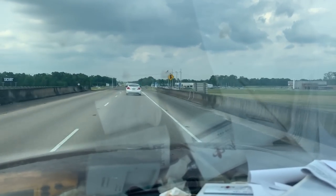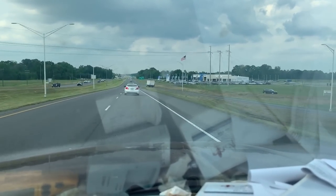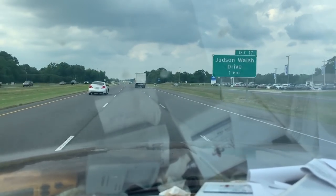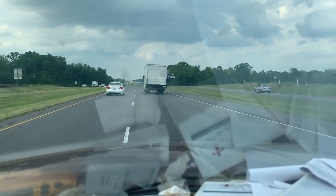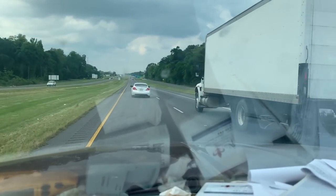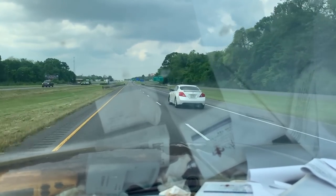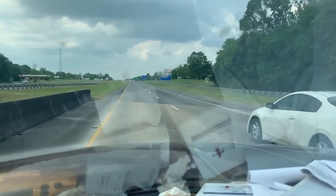Went and caught my other calls, and now I'm headed back over there. It's got refrigerant in it, so I'm gonna run a combination of the electronic leak detector and some big blue soap bubbles and see where they left the leak at. Now, it does have an expansion valve on the coil and it's a bolt-on. I don't know if that was factory installed or field installed, but we're gonna check it first. And if that doesn't hit off, we're gonna check the company solder joints and go from there. So I'll see if I can get some film on it for you guys.